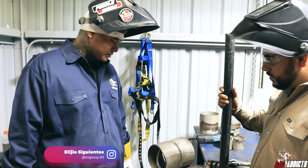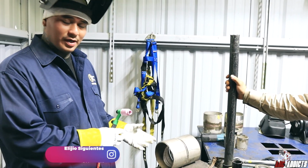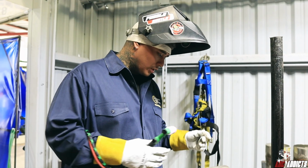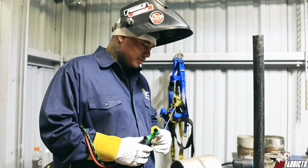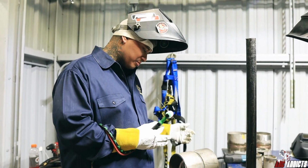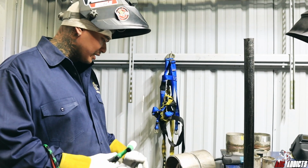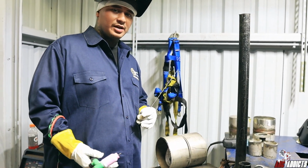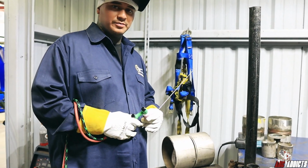What's up, guys? I'm Elijio Fuentes. I'm going to show y'all the process of setting up the pipe, tacking it up, and getting it ready for root. What I'm going to do right now is bridge tack it. Since it's a pretty big size pipe, I'm going to do 3 tacks. That way, whenever you start welding on one side for the root, the other side doesn't close up.